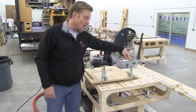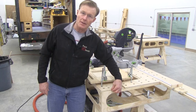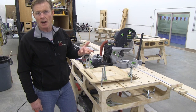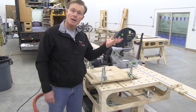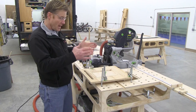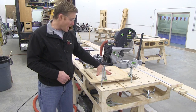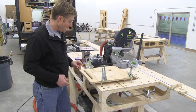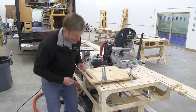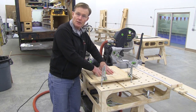The dado end for the router plate — the thickness of the router plate takes up quite a bit of the thickness of the top. The top is a half an inch, so we're leaving basically just a little onion skin; it's not enough to hold the router plate up for any length of time. So I back it up with another piece of half-inch. I cut a piece of half-inch plywood to the outside dimensions I need, put that on the plans, then found center on that backing material — I made a cross line, and my router template has marks so I can just center them up.